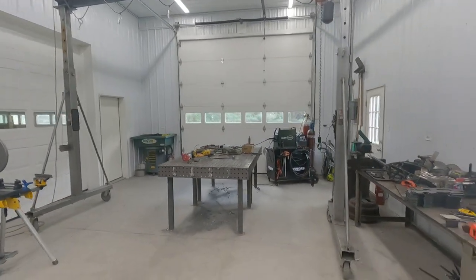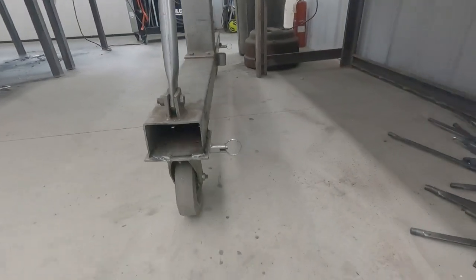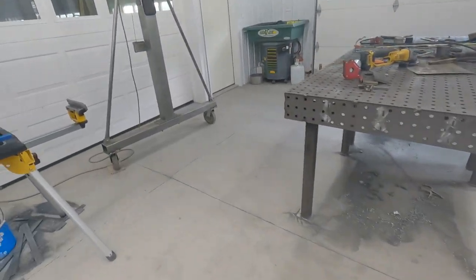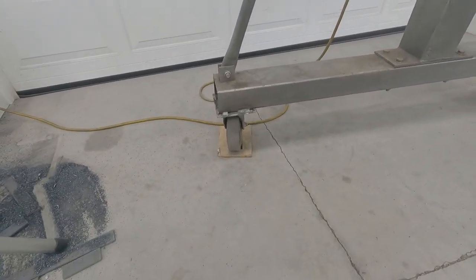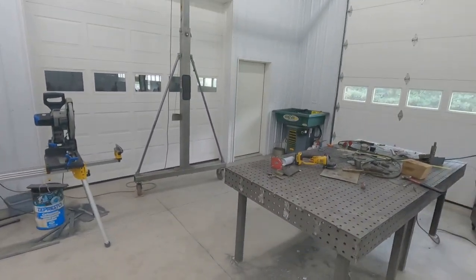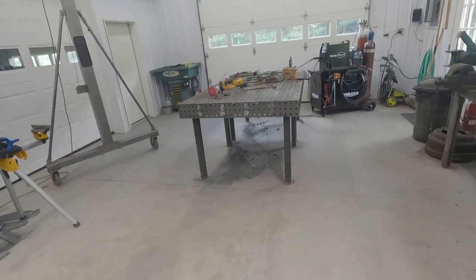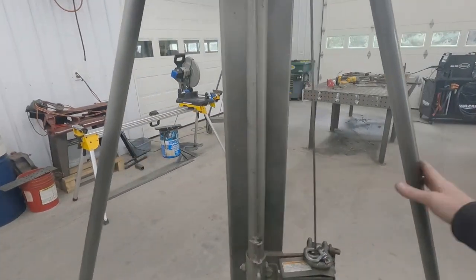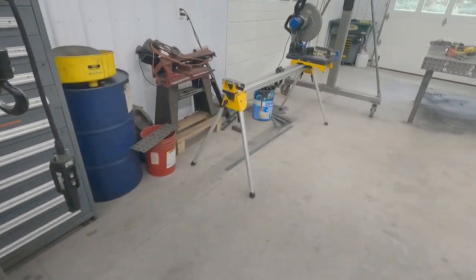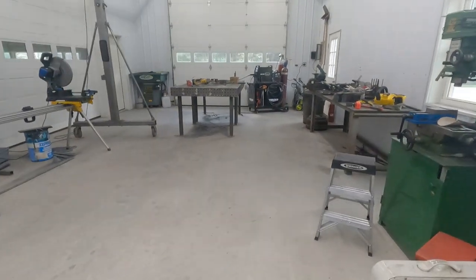The other thing I did was purchase some larger diameter caster wheels, and they do have locks on the caster which will keep them from rotating around. With three caster wheels allowed to rotate, I made a simple wooden block for the fourth that the wheel fits down into so it can't roll — almost like a brake. Now what that lets me do is rotate the entire crane right around; it'll pivot on that one wheel and lets me rotate the whole gantry crane to move material in and out of the way off the welding table. I'll show you how that works.